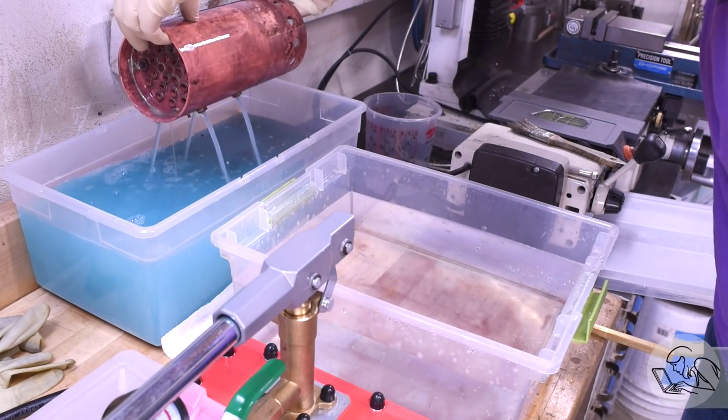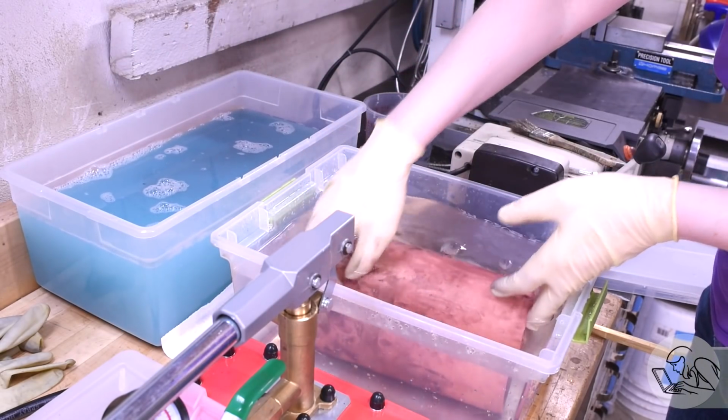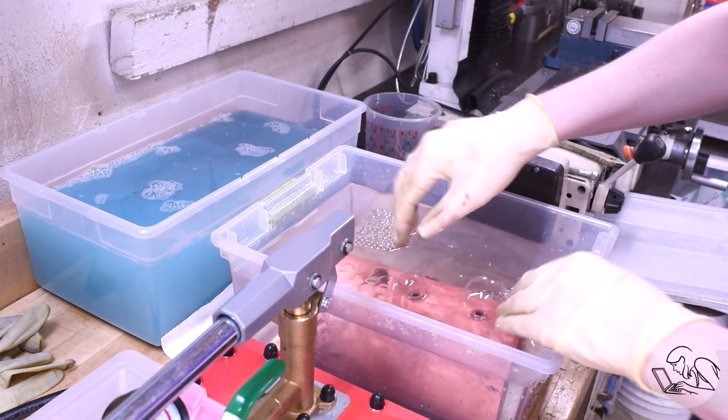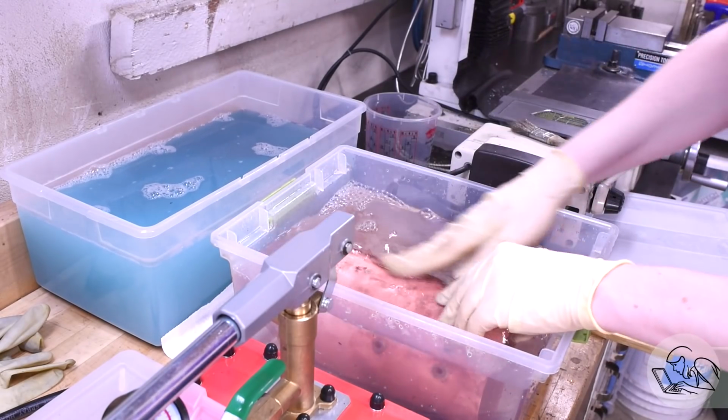With that Sievert torch and a proper hearth setup, heating up that joint only takes 1 or 2 minutes, which is about what you want. Any faster than a minute is probably too fast. You're probably stressing the joints. And longer than 5 minutes, and you've probably spoiled the flux.